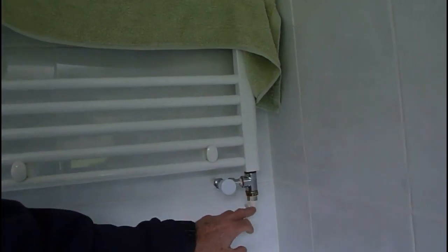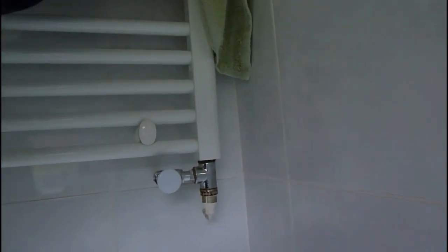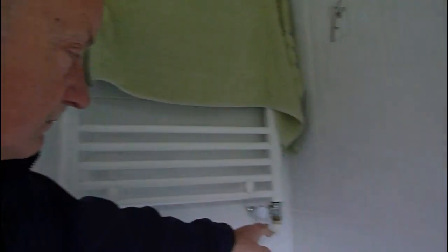So I've come up with another idea — I couldn't afford that. I was looking at my towel rail and I suddenly realised it had an element called a towel rail element that goes up inside the radiator and heats it up. I thought, let's have a look at the wattages of these — you can get them at 250 watts, 300, 400, 500, 600. So I decided I would buy one of these elements and put it in my water tank. It's not dead easy, but if you give it to a plumber it could be done for about £150, or if you do it yourself the parts come to about £50.